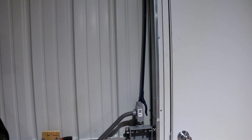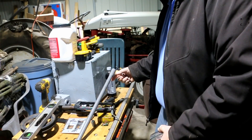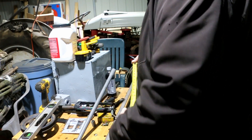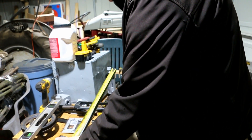Take it up to the top. Bend it so it will match the bend up at the top and then go over onto that lower truss beam. The marks I'm putting on this conduit are just reference points — I'm going to have to fit it as I go, but it's going to work quite well.